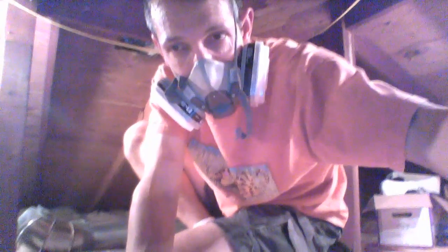Okay we're back, we're in the attic — sorry if it's a little muffled with my mask on and there's an exhaust fan going. I measured six feet from the intake to my switch location, so that gives me a reference point. I found the top plate here in the wall, and six feet away from there is right at the intake. Here's the top plate right here — I'll just move the insulation back. Six feet is right about here, so I'm just gonna drill a hole there and pass the wire down through it.